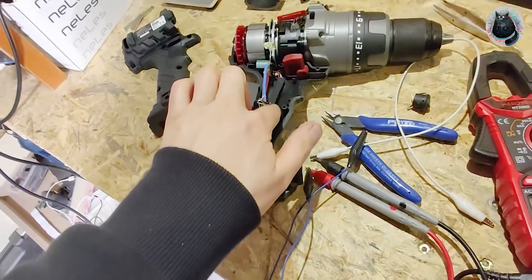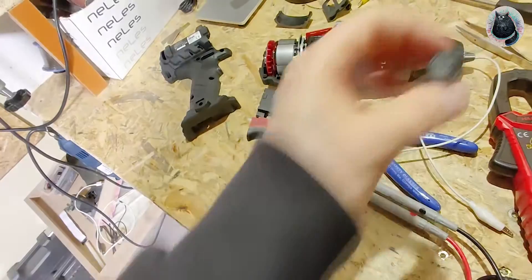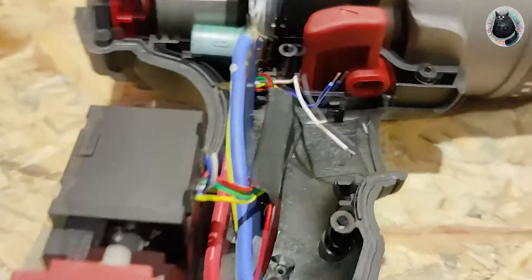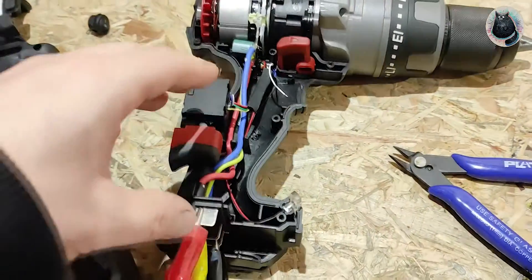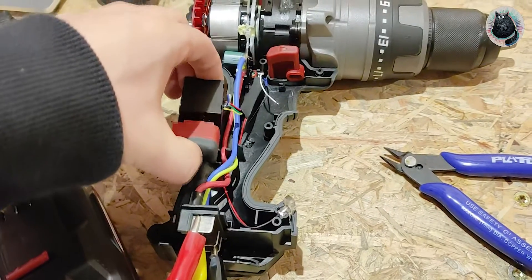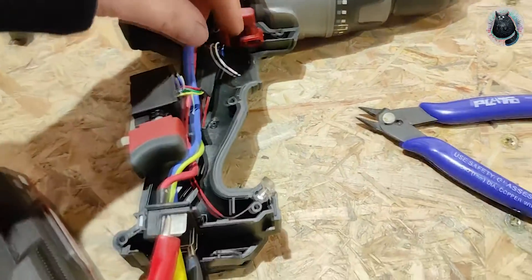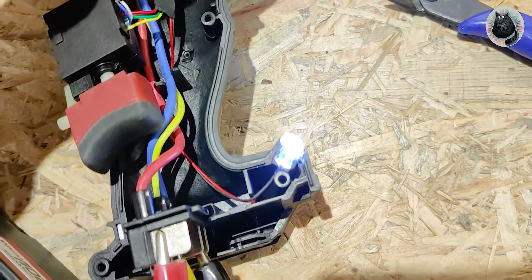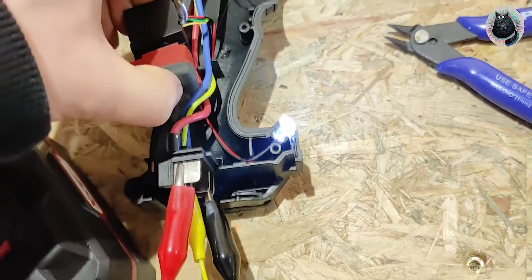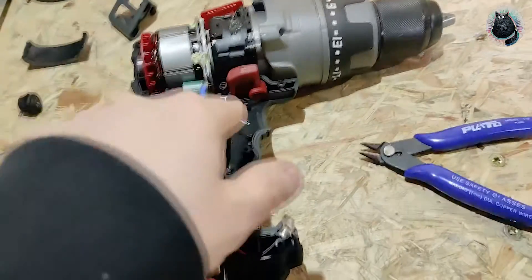What are we doing here? We are connecting now these two wires. I'm first going to try and just connect them together, see what it does with the battery on there. If it works, I'm going to route it through to a button. The battery is connected to the drill again and I've got the blue and white wire stripped and ready for connection. It works as I thought it would. So if I press the trigger now, see, it doesn't do anything - it doesn't work at all, also long press, nothing. The drill is sleeping. And now when I connect these two wires, you will see the light come on. There you go - the drill works. If I connect these two wires permanently, the drill stays awake. So I'm going to extend those wires.